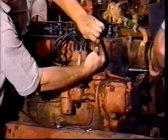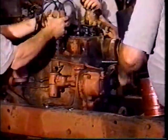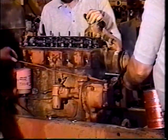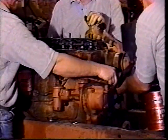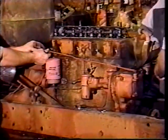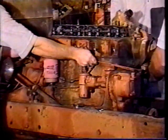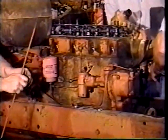While they're doing that, I'll see if I can get this water pump off here. You got a milky oil up here. Terrible. Your governor linkage has a cotter pin here in the front. You got to take that out, and then on the back side, there's a little nut, kind of an adjuster for the linkage. Loosen this nut up, and then you can slide your governor linkage right out and take this thing out and hold it in a good place. Keep that.